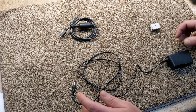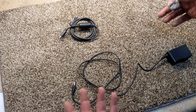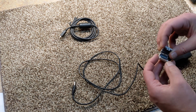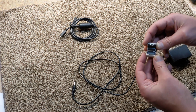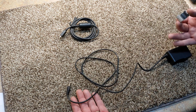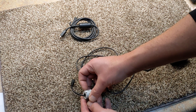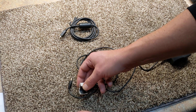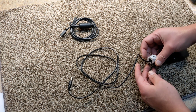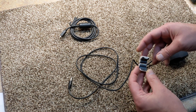What you want to do is get a ferrite ring — also called a ferrite bead. There are a few names, but it's basically encircling the wire with ferrite. Here's a ferrite ring. If you put it near the end where the power or signal is coming in and enters the device, it'll work a little bit, but not greatly. It's more designed to be closer to where the signal is coming in. I did that and it worked about half the time, because this one isn't made specifically for it — it's just one I had lying around.